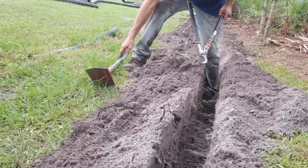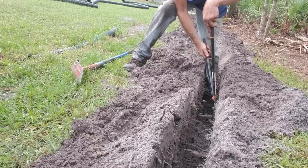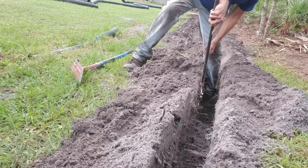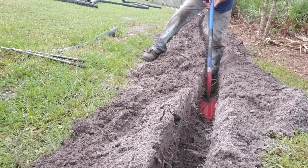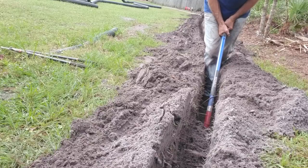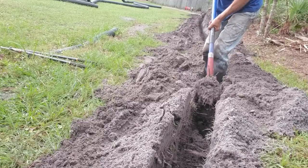It's hard to get the trenching shovel out past the tree roots — you can see them in there. So if you have a pair of loppers, try to get as many roots as you can. You've got to be over as far to the side of the trench as possible. Tree roots are not limbs — it's worth a try, and then you can see the shovel comes right out if you got the root cut to the side. You want to try to save your back because this is intense labor. I actually go ahead and get down in the dirt because you get more leverage. We do this every day, so I tell my guys to not be afraid to get dirty.